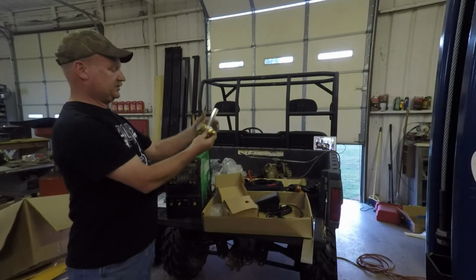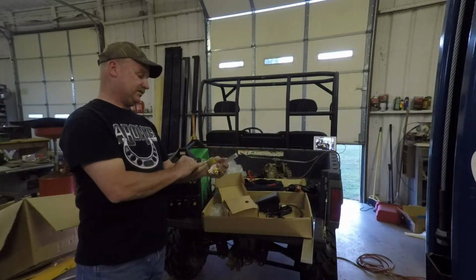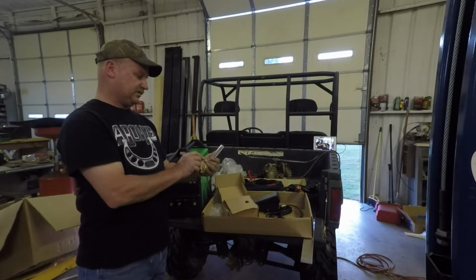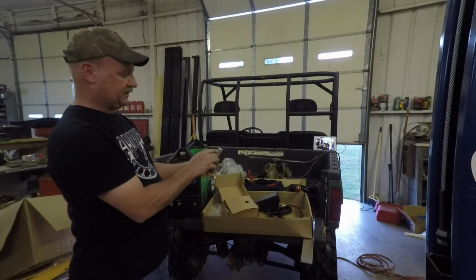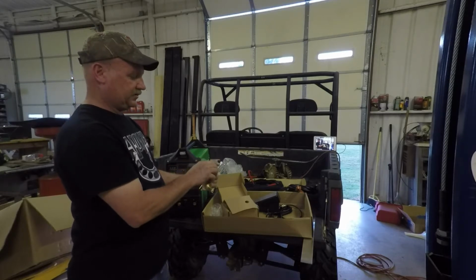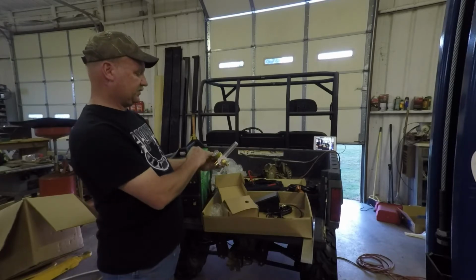Let's sit this way because there's the gauge. I've also heard that this is in cubic feet per minute or whatever it is, and it's not. See, SCFH is cubic feet per hour. I don't know what the S stands for, something. Cubic feet per hour, and this is your pressure.